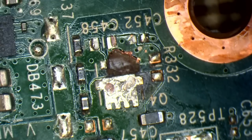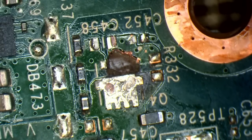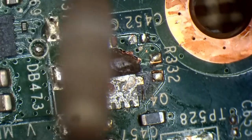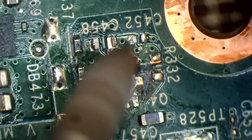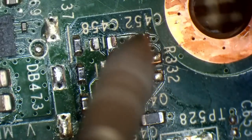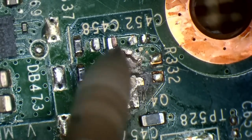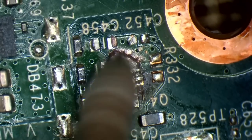I've got a little grinding pen — it's only a cheap one but it does the job. It's got a little attachment on it and I'm just going to try and grind away at some of this to get rid of the carbonisation. I'm going to put it on the low setting and see how that fares up. Ultimately what I'm trying to do is separate layers and try and relieve the short.